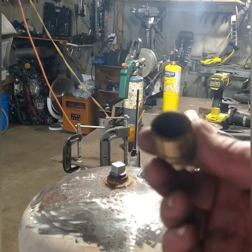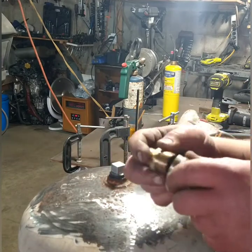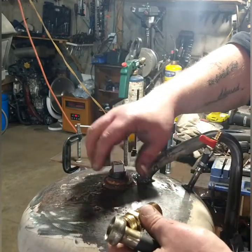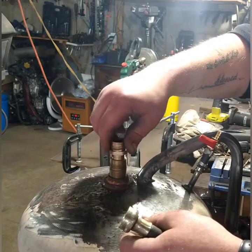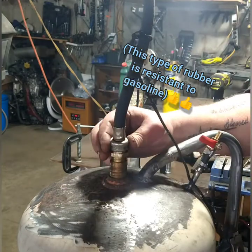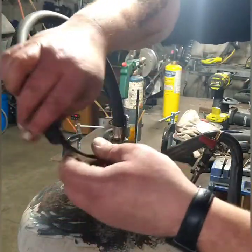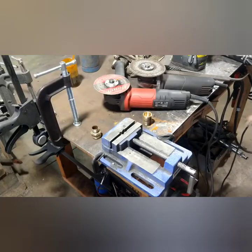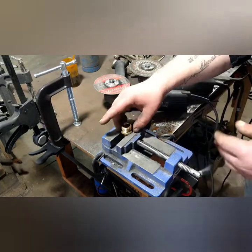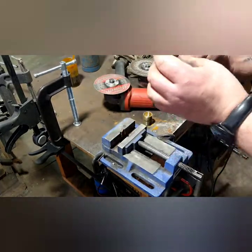For the spigot part I have a three-quarter threaded brass nipple, about two inches. I picked brass because it's going to seal better, and I have another part that goes into it — basically a half-inch to three-quarter coarse thread fitting for hoses, and an old utility water line off a washer and dryer. To plug the hose when I'm not using it, I just have a rubber plug connected to some paracord. When you use old parts that have been laying around, you basically have to clean everything thoroughly. I'm using a flexi hone — this is half inch or three-quarter, I can't quite remember — and a wire brush, whatever you've got.